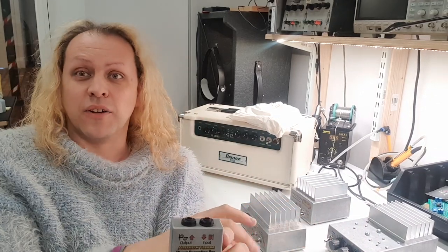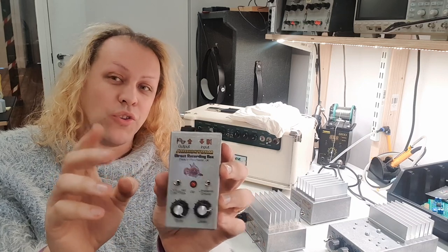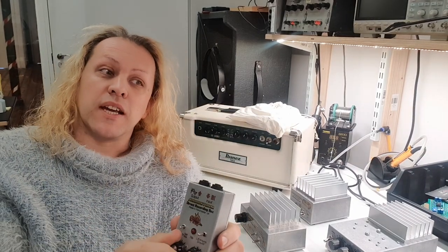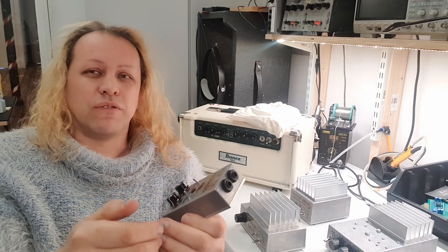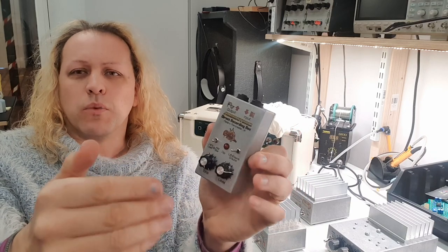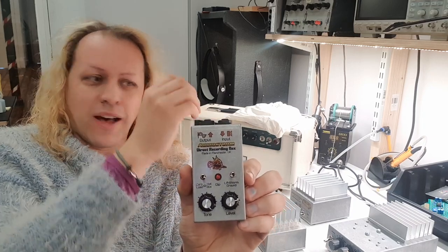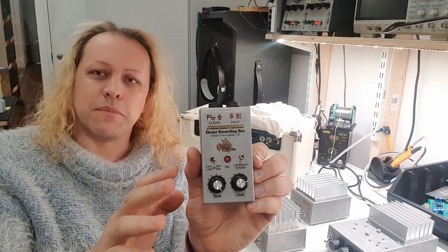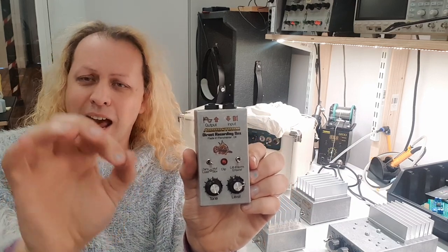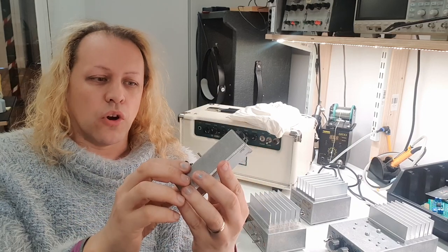You can also use it with amplifiers of five watts or under on its own in hotbox mode. These are only available in 15 ohm, and there's a reason for that: ohm matching is mainly about power transfer. When it comes to voltage transfer — which is what we care about for signals and audio — we don't care about the power, we just want to make sure everything's safe. 15 ohm ensures this works perfectly with 2, 4, 8, and 16 ohm attenuators. We're not driving a speaker; we're only interested in having something to absorb the power and tap off a little bit of voltage to send to our recording system.